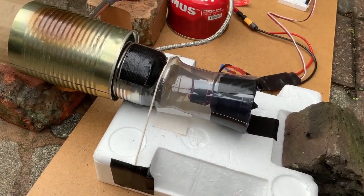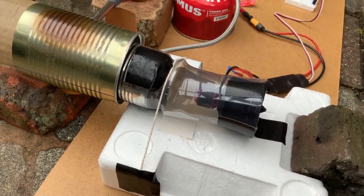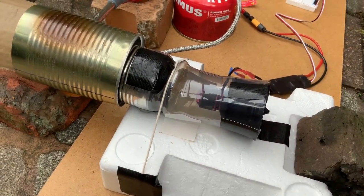If you look at the bottle here, it's kind of smoked out. This is because I did a test fire to check that the igniter was working, but then it backfired and went through the motor instead. This has got me thinking — maybe my original design wasn't so bad. Maybe all I needed to do was increase the size of the bottle that the air goes into before it reacts with the gas, to create a region where there's a slightly lower pressure so there's less oxygen flowing that's more controllable.